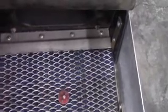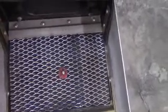Now up under the header, this is the head end of the box, Keen puts in an aluminum plate that goes underneath this tab, and on top of that aluminum plate, there's a rubber mat that catches the gold. Unfortunately, as the material comes up, it wedges that aluminum plate in, and you have to fight to get it out. Their theory is, well, you can see the gold you have laying on that plate. And I'm not really interested in seeing it, I'm interested in catching it. So I've taken that plate out, and I've installed raised expanded, as you can see, and below that miner's moss.